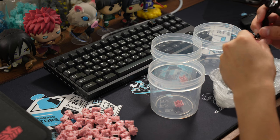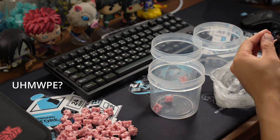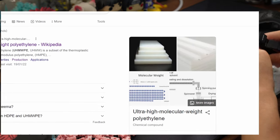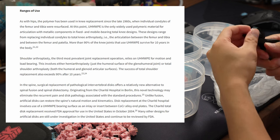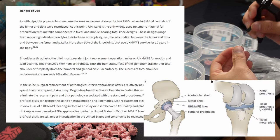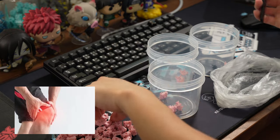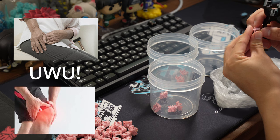The Oogle does not have this off-center friction. For those who don't know, what is UHMWPE? It stands for Ultra High Molecular Weight Polyethylene — a material used for durability and lower coefficient of friction, unlike POM. Going off topic here, the Oogle material has also been used for shoulder, knee, and hip replacements. This article states the material is used on articulating surfaces of the joints, so if you know someone who's had a joint replacement, ask them about it and tell them how it is used in mechanical switches.